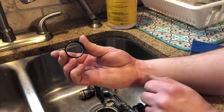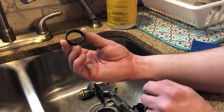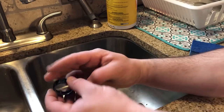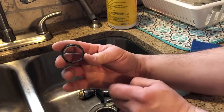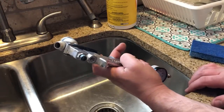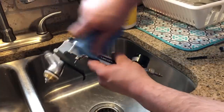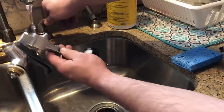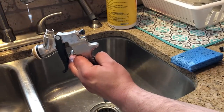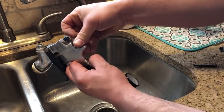Once the tip is clean, set it aside. With the collar, there's a little washer inside — always make sure you keep that in there, because if it falls out it can be easy to forget about. Scrub the outside of the collar really well and put it in the drying rack. Last but not least, run water over the outside of the gun and scrub it down really good, rinse it off, and you're good to go. Then reassemble — just the reverse of disassembly.